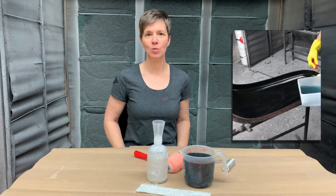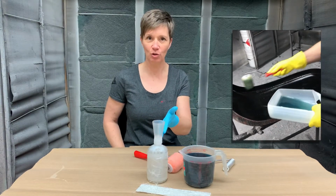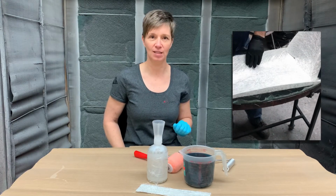Back in the room where all the steps in manufacturing fiberglass parts are taking place. Once the gel coat has dried, each piece of fabric is laminated in the mold. To do so, we need to mix the right amount of resin with the right amount of hardener, and the ambient temperature has to be taken into account when calculating the amount of hardener.